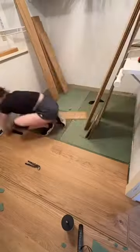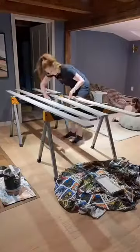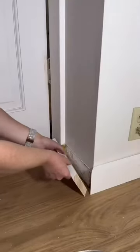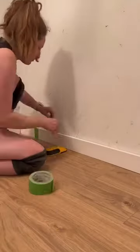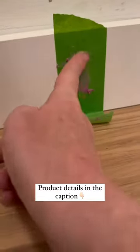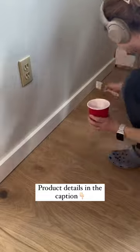Then I finished installing the rest of the floorboards and got onto my baseboards. I painted them first, then made my measurements and cut them to size — I used miter joints in this room. To fasten them to the walls, you use a stud finder and shoot nails right where those studs are. Then fill the nail holes, caulk your creases, and make your paint touch-up.